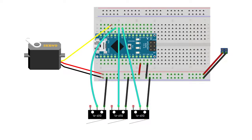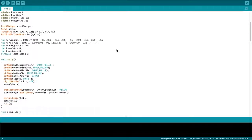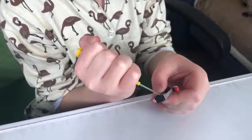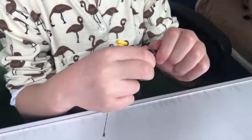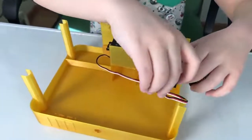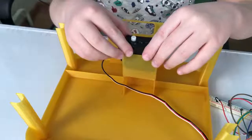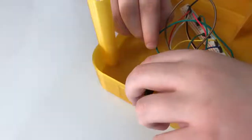Use this circuit for the wall-powered version, and this for the battery-powered one. The Arduino code link is also in the description. Remove the levers if your buttons have any, we don't need them. After you connected all the electronic parts, put them in your electronics compartment. The motor goes into this slot and the buttons into these slots.